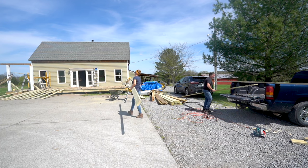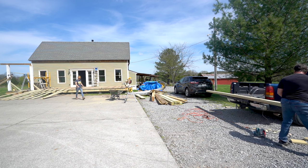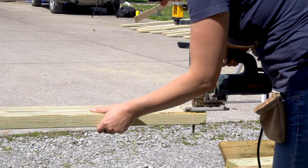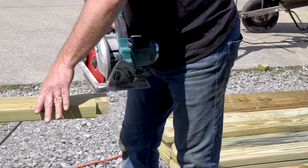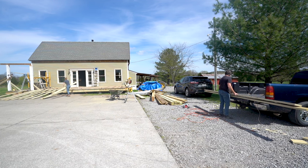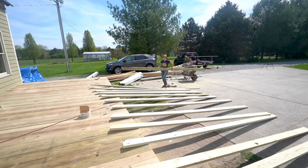Greg and I found a really efficient system for cutting these out quickly. He would grab a new board from the raw material stack and set it on the tailgate — a wonderful job site workbench. He'd place the template on top, line things up, then use the circular saw to cut the length and make the majority of the cuts for the bird's mouth. Meanwhile I would make the finished cuts with a jigsaw to get a clean 90-degree corner. It's tempting to overcut the corner with the circular saw, but that weakens the connection, so since this will be around for a long time, take the extra time to make it clean. After finishing their cuts, I'd take the completed rafter to the porch while Greg grabbed the next board to repeat the process.